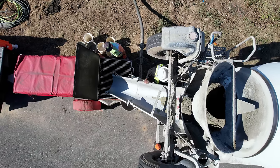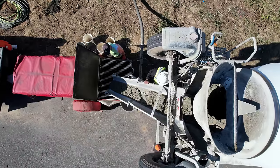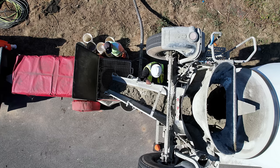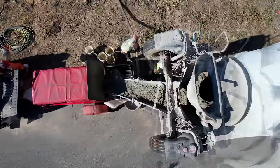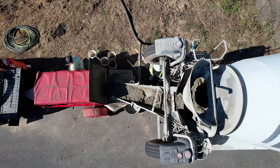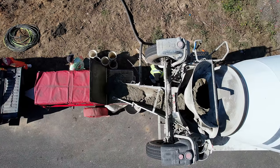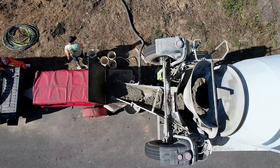You are looking at a top-down view of the concrete mixer truck. We are checking the mix to make sure that it came out exactly as we ordered — and by we I mean Ryan, the pump operator. He's checking to make sure the mix is going to flow nice and easy through his hose, not too loose where it wants to run out of the footings, but not so stiff that the pump is working too hard.